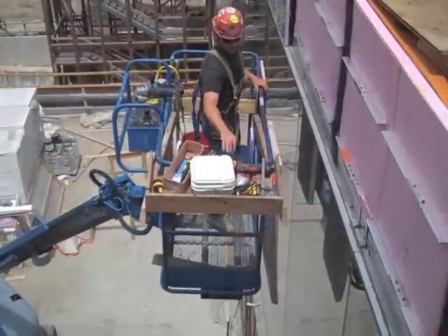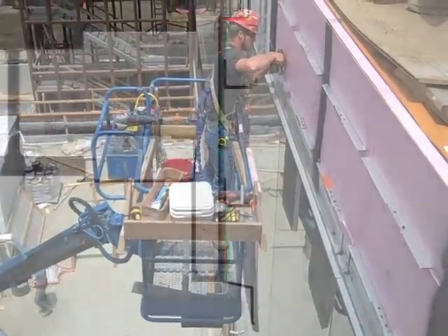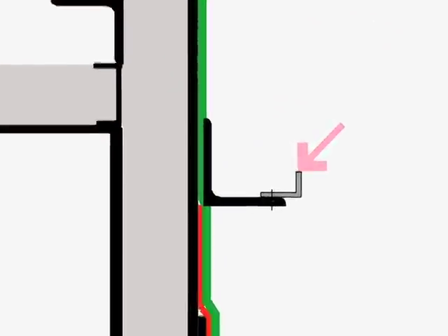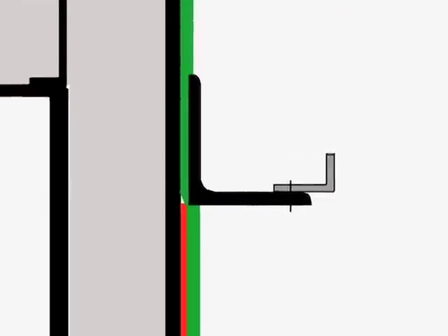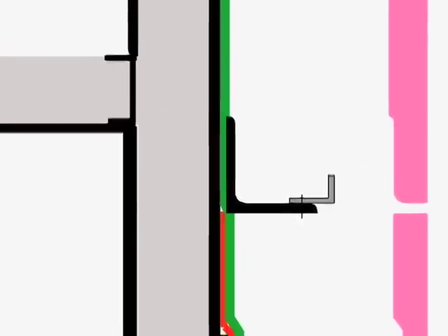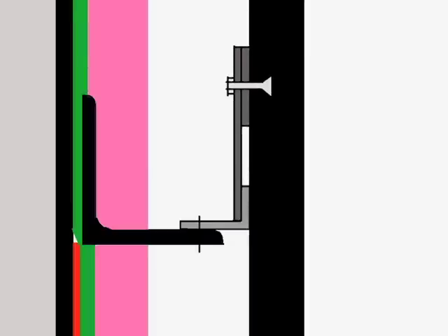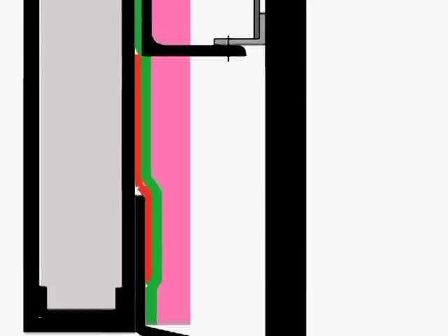But back to the stone veneer. Small angles are screwed into the clip angles to support the stone. These clip angles are positioned with plastic shims so that they are at precisely the right height. The fourth control layer is the insulation, and it must be outside the air-water vapor barrier to keep it warm during cold weather. The stone panels have metal plates fastened to their inside surface, into which the small angles screwed into the clip angles earlier are inserted. The stainless steel flashing provides a drainage channel for any water that might get into this cavity through the open joints of the stone veneer.